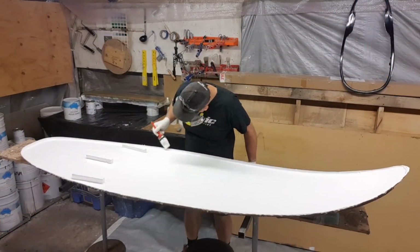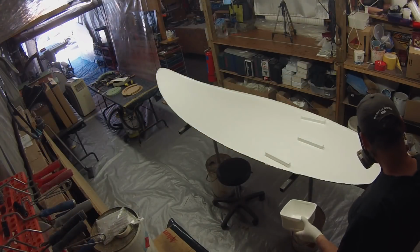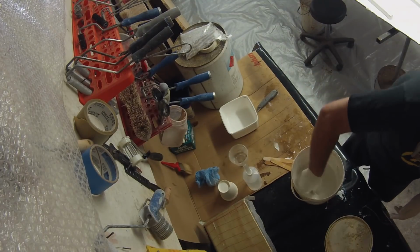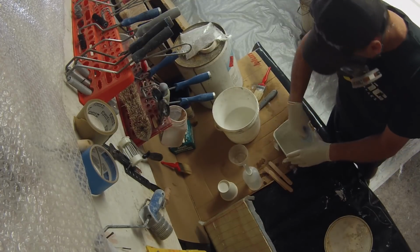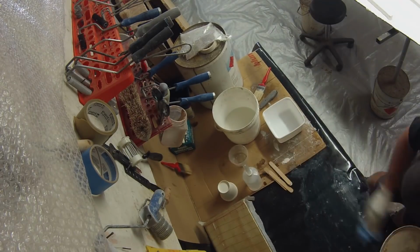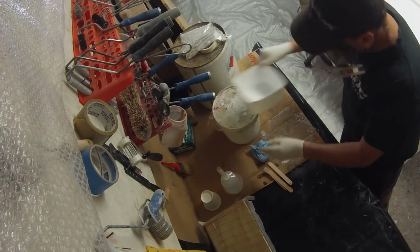There really isn't a need at any point, provided you're putting the right amount of gel coat down, to apply it twice. And then ultimately the wash up here is very important as well. Immediately after gel coating, I will paint out the excess gel in my brush onto a piece of cardboard, and then I'll rinse it in acetone and squeeze the excess gel coat out of that brush, and then ultimately give it a good clean out.